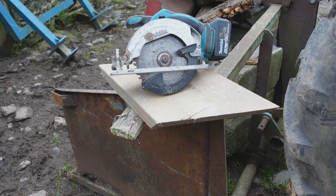A while ago I went into a power tool dealer for a spare part for a 20-year-old Makita jigsaw — just a blade clamping screw — and he laughed at me. He said 'have you still got one of those things? I bet you haven't used it much.' Well I used it and used it and used it. He said they always wore out on the gearbox, and I said 'do you know why?' He said no, so I said because they use them with blunt blades. Since then I've heard him repeat that tale to a lot of people he's been trying to sell blades to.